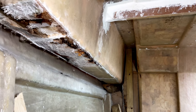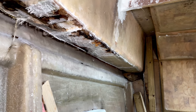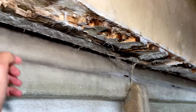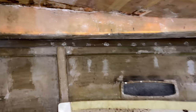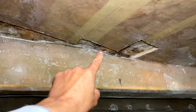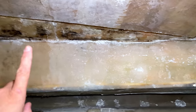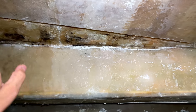So we're just going to cut now all the way down to the bottom, and we'll get the rest of that damaged core out, and we'll also remove all this ruined, no good, rotten balsa. And on the other side, Richard has removed all of this damaged core as well. So a nice big triangle cut out here, and then he's just come in and removed all of the bad core there. So what we will do is come in as we did before with the damp meter and check all that, and then we'll be able to sand all that down